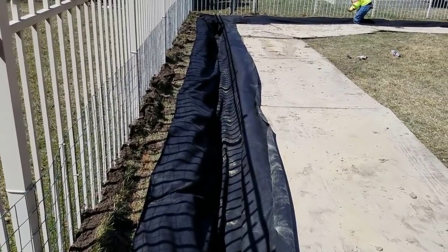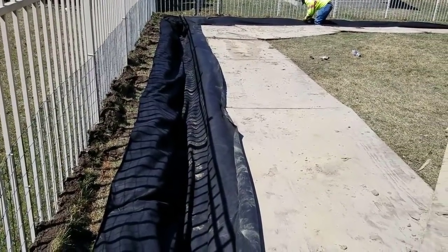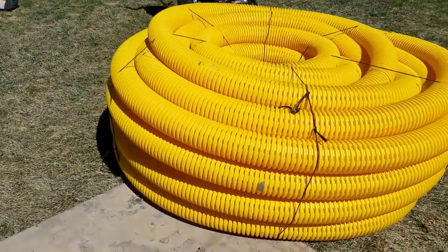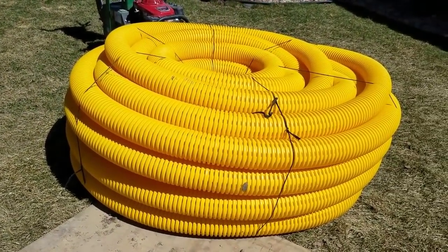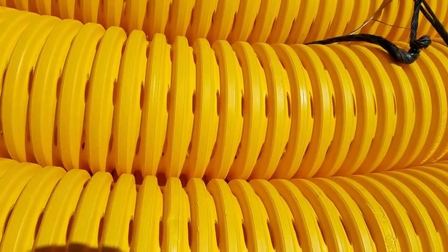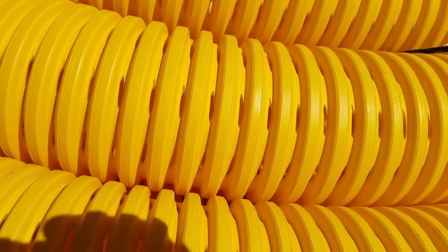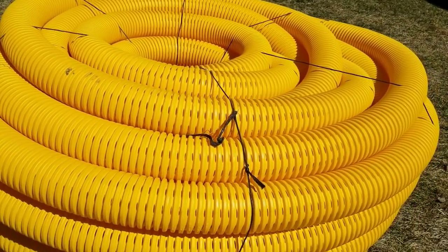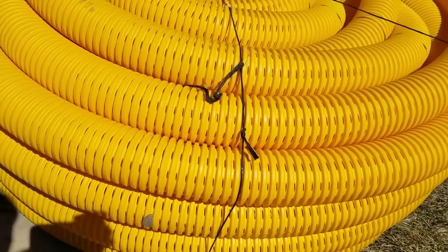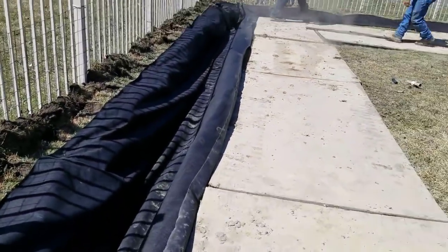You can Google it and find it. I can't ship it because the shipping for our pipe or our fabric is so expensive. I've had a lot of requests to ship this pipe and as soon as they hear the price, they say they'll just buy a Dremel tool. You can buy a Dremel tool — this pipe has eight slots per valley, while Home Depot's pipe has three slots per valley. Just take a Dremel tool and remove a little material to create an inlet. With eight slots per valley as thick as a U.S. quarter, that is 11.5 square inches of inlet per linear foot — that pipe is going to move a lot of water.